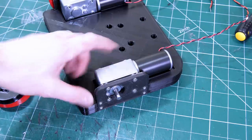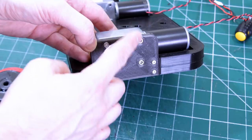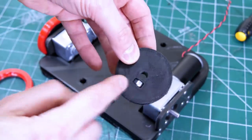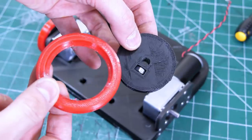My motors are fitted into those recesses with a plate on each side screwed through both layers, and I've got recessed socket caps so that the wheel can go flush on the outside. The wheel is of course 3D printed — there's a captive M6 nut with a grub screw that binds on the shaft, and the tyre is 3D printed in NinjaFlex.